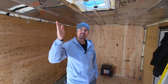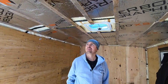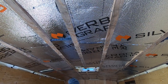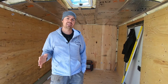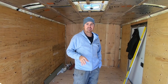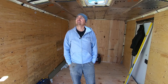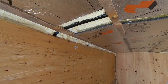So we finished off insulating the ceiling — we're about 90% done. I've got a little bit to do just filling in these small areas, but this gives you the overall idea of what we're doing. We've added all this extra insulation. I ran the little heater in here because I was doing this at night, and within five minutes running it at medium it was toasty warm and I was working in a t-shirt — and that was with about minus 10 to 15 degrees Celsius last night. I'm pretty happy with the overall insulation and how quickly it's going to warm up once we get our proper heater going. Next step is finishing off these little voids and then sheeting this ceiling.